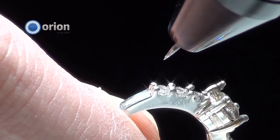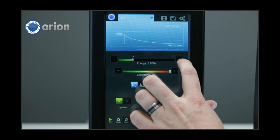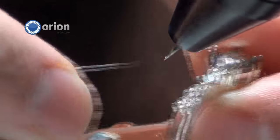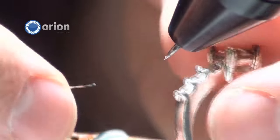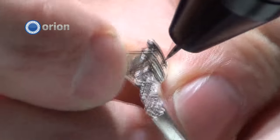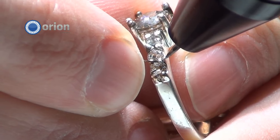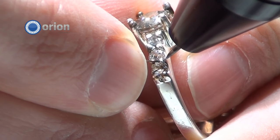First I'm going to move my energy down — since this is a smaller prong, I'm going to go down to about 5 watt-seconds. That's quite a big change. Then I'm going to use 30 gauge wire. I can use anywhere from 26 to 30 gauge with no problem — it really comes down to the prong and the technique you like. The wire actually didn't attach to the prong, but the metal from the wire got sucked down onto the prong and added itself to it.